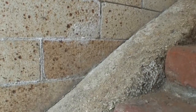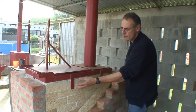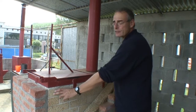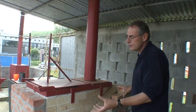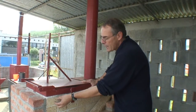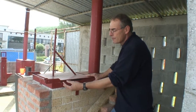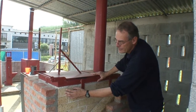The real core of the De Montfort incinerator is what we call refractory or heat-resistant bricks, and you can see they are built up in several layers here. There are several models, but the ones we are using mostly have a very high aluminum oxide content. They are heat-resistant, and they can also deal very easily with temperature variations.